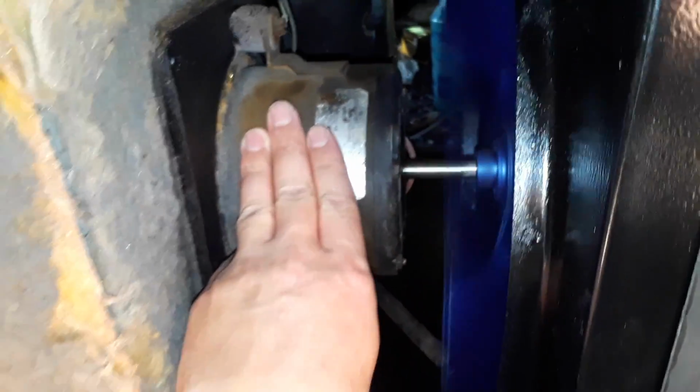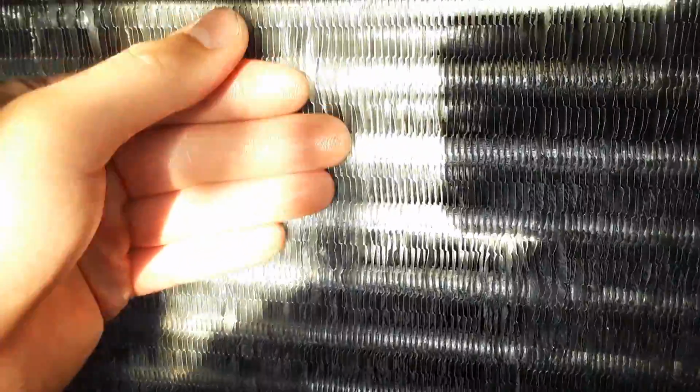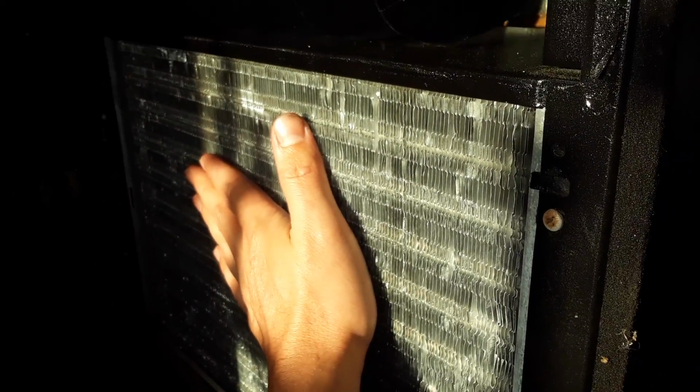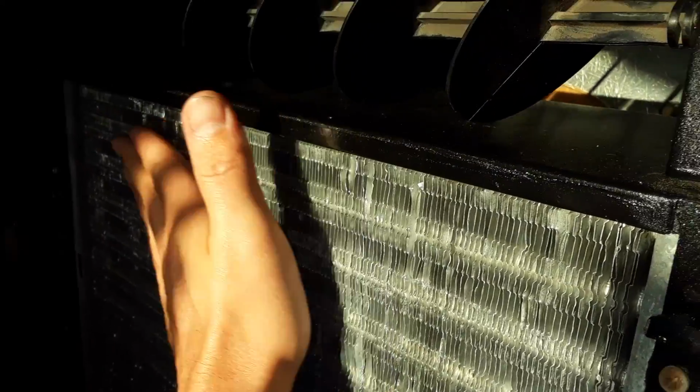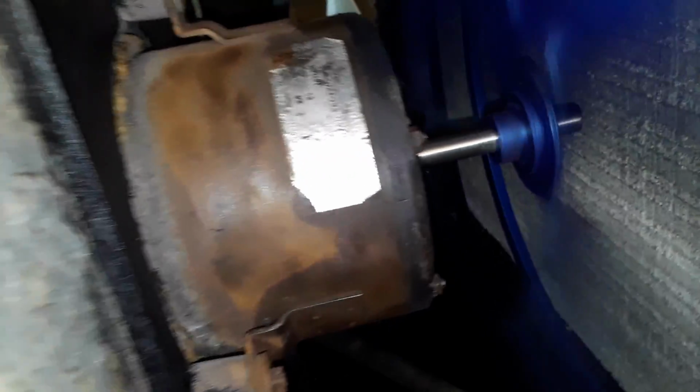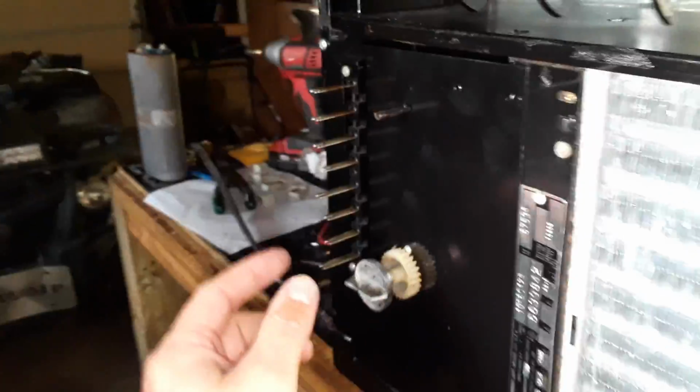And it's getting warm. Now I know it does get warm with regular operation, but I can't help but feel like something's wrong. Like I said, that humming noise is driving me nuts. The top part of the evap coil is getting cold, but it doesn't even go half of the way down. So I'd bet a paycheck that it's low on charge. Definitely needs something. But yeah, I don't smell it, nothing smoking. I don't get it.